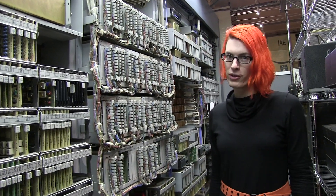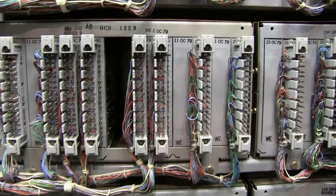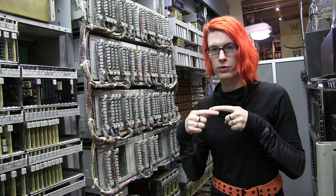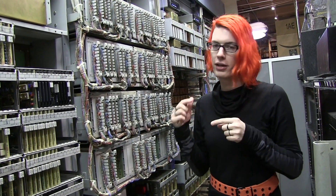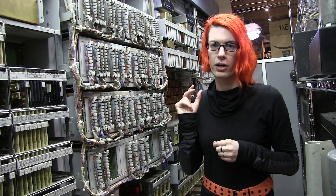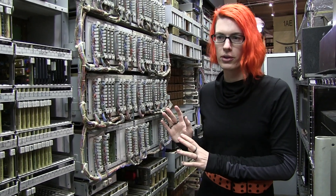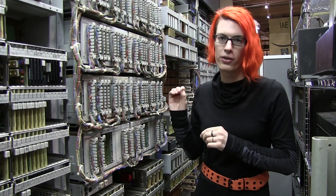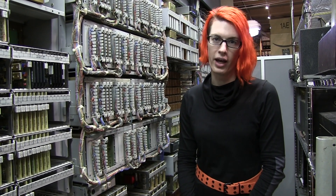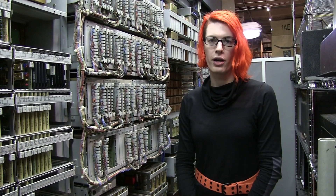This next frame is the network frame. All of the customer telephone lines come in on wires and land on metallic terminals here. Those metallic terminals go into magnetically switched reed relays — a glass envelope with two metallic contacts, very small, operating on very little power. They're magnetically sticky: once the coil energizes them, they stick closed or open depending on what the software set them to. This means the machine is completely analog as far as the customer is concerned. The computer only tells the network when to open and close — very different from modern digital switches such as the DMS-10, built at the same time as this machine, and the 5ESS, which is what most cities have today.